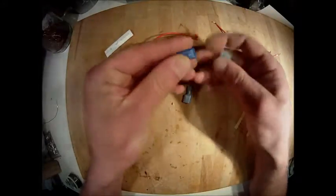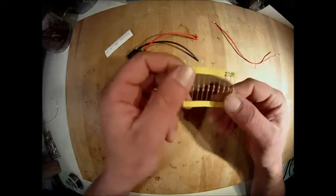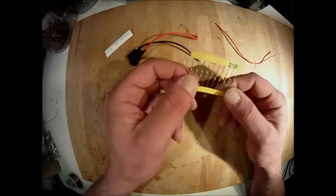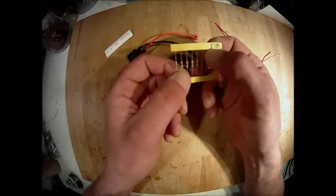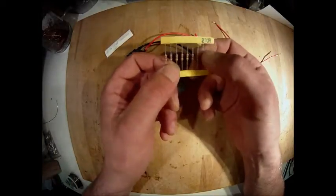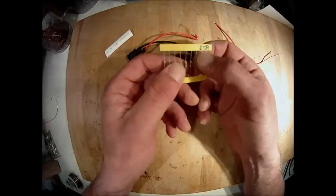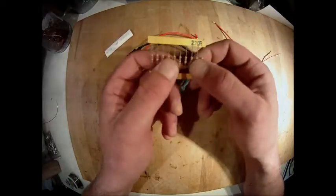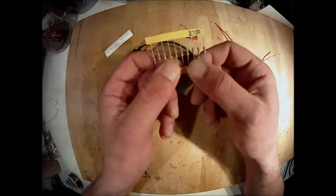These are special connectors for these wiretaps - they will be inserted like that. You'll need those and some resistors. I had 270 ohms just lying around so I'm going to use those. You can use anything from 180 up to 390 ohms. Make sure it doesn't say a K after the number because that's kilo-ohms. You want only 180 ohms up to 390 ohms; you can choose 270 or 330, as a lot of people online will recommend 330 ohms.